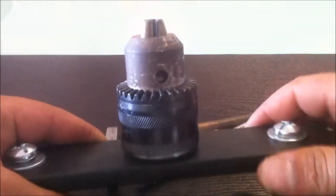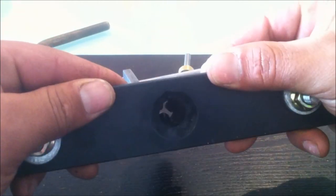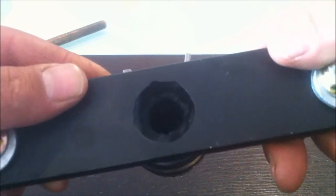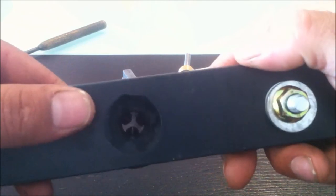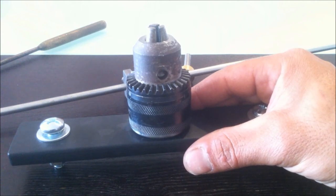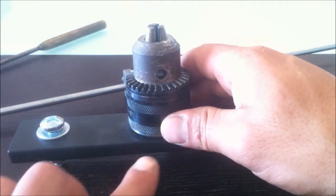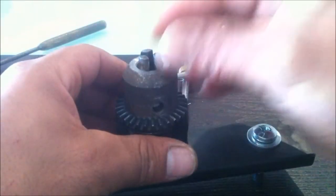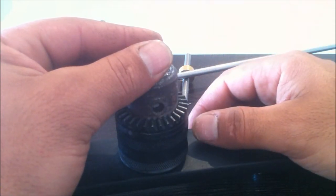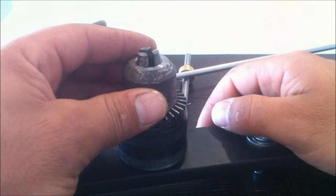Now, the tool that I had to make that tool was this tool here. So this thing is just a standard chuck. I have welded it to a piece of flat bar. Just drilled a hole in the base of the flat bar there so that it can receive the rod. And I've just got two mounting holes on either side. So that actually attaches to the plate on my pedestal drill via these two holes here. And the chuck sits over the center of the hole in that plate. And then I can just feed up a rod through the center and then align that rod with the chuck from the pedestal drill, and then bolt everything down, remove the rod, put the drill bit in, and we can drill a centered hole in the end of a rod.